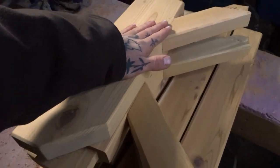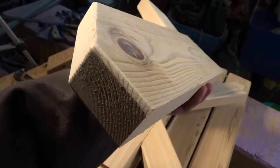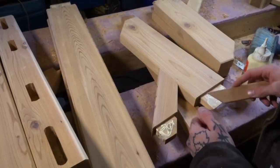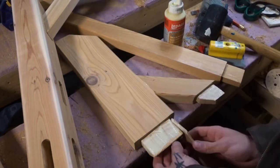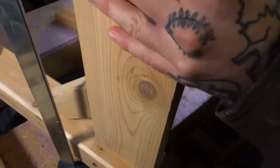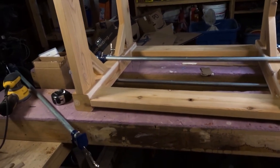Yesterday my camera's SD card ran out of space, so I couldn't record all of this, but I think I got at least a little bit. I sanded it off, we chamfered it with the router, sanded it off, and now it's basically ready to go. It's been about a week since we last worked on this thing. All I really did was glue all the pieces together - all the joints are all set. Next we'll be moving on to the tabletop. I've got it planned out, it's pretty much all ready to go.